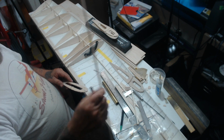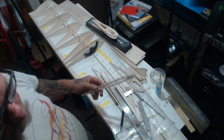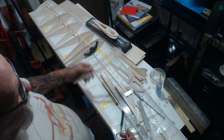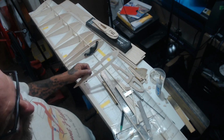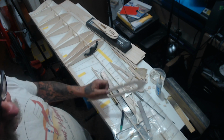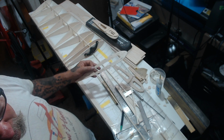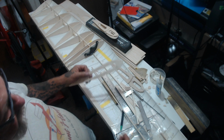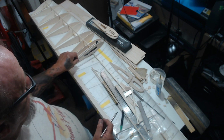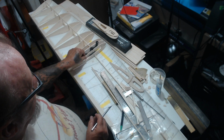So I make each piece a 1/16 of an inch smaller in different spots. That leaves one piece out times 4. This has eliminated probably 4 ribs at an angle, Warren truss. So that's 4 less ribs that you don't need. So that's how you make things lighter. Leave parts off.